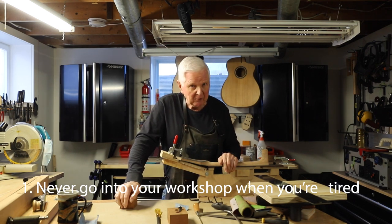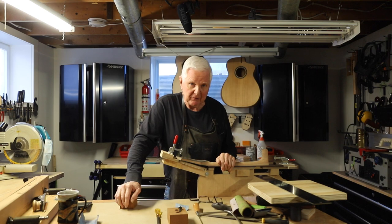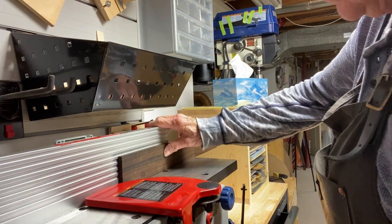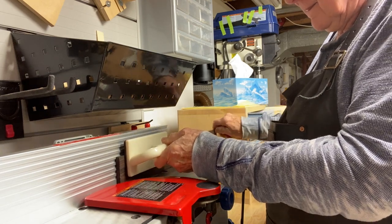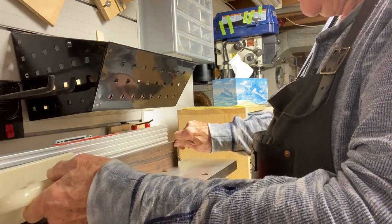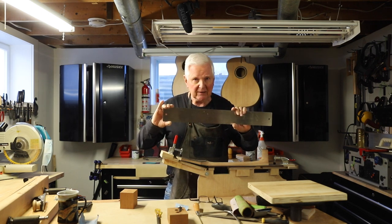Let me give you an example right here on the guitar that we're working on. Over on the side here, you'll see I have a planer, and here you'll see a video of me planing a beautiful fingerboard. Now, I had saved this piece of wood for well over a year. I could not wait to cut it and do it right. And so I planed the side, but I didn't notice I took a little too much pressure on one end of the board. So consequently, if we look at this as the board, this end was a little narrow.